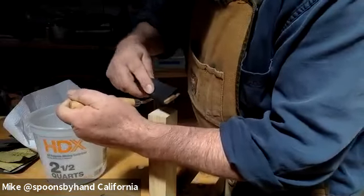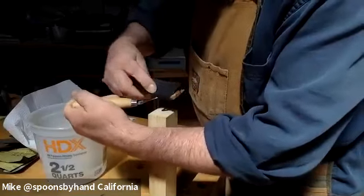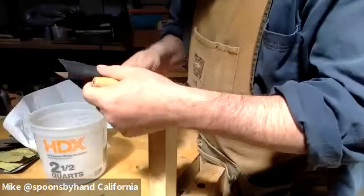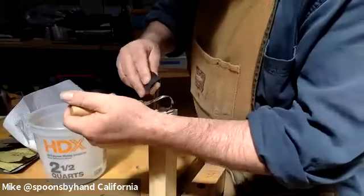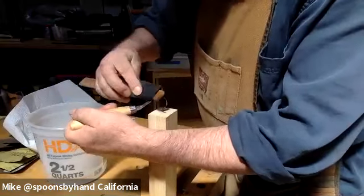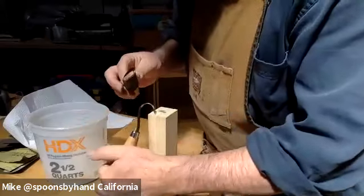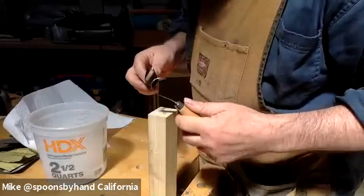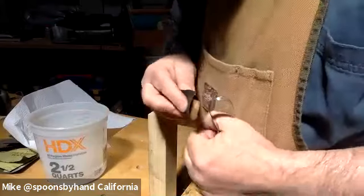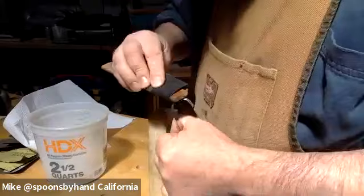And then you go all the way up to 3,000? No, I'm lazy. I only go up to 2,500. Okay. And then I strop. I also don't worry too much about the aesthetic look of the bevel, as long as it's overall the right shape and it's looking good at the cutting edge. I don't worry about it, because there will be some errant deep scratches left over from the first Dremel sander thing. And then this part's hard. I think I need a dowel or something almost for that. I don't know if you can see that. And like with all sanding, the first one's going to be the hardest or take the longest.